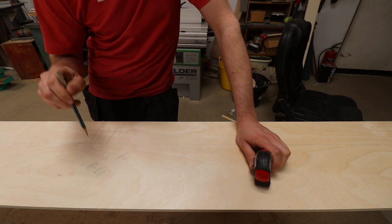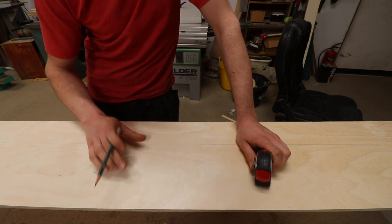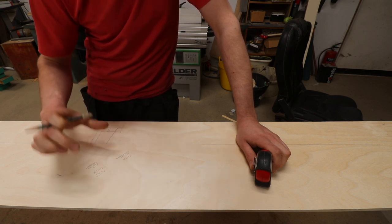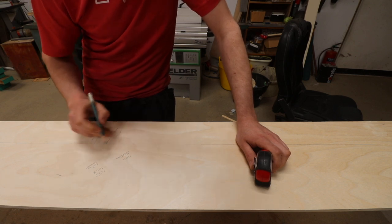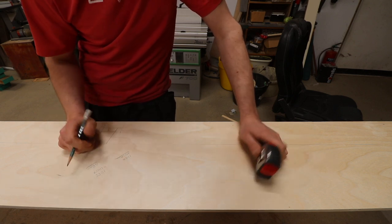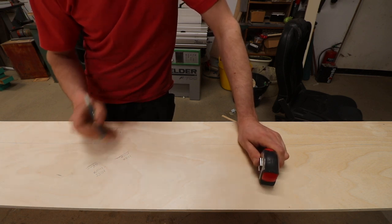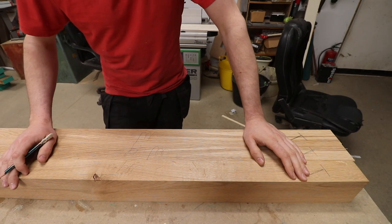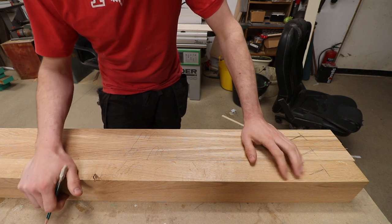different. So if we take the height of any of the other windows, if they're exactly the same construction, head and sill sizes, all we've got to do is take that finish height window, take 48 mil off, and that is the cut height for the uprights in that window, or the cut length. So we can do them all off of that measurement there. Save that rod. You can draw one of them for every window if you like. Not particularly necessary if you've done it once,